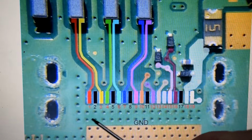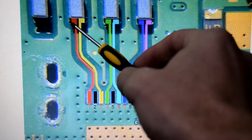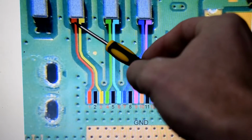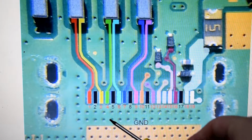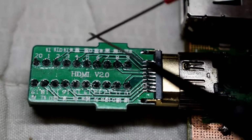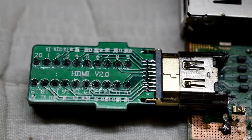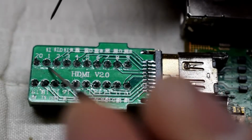And you want to make sure that there's no continuity between each of the coils between pins 1 and 3, but there should be connection on either side of the caps there. So you want to test that out following along. And in continuity mode, you want to test 1 and 3.